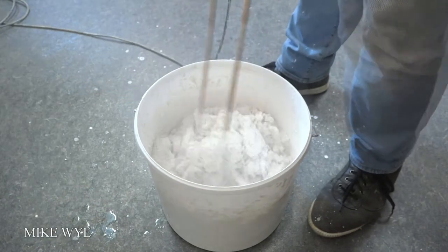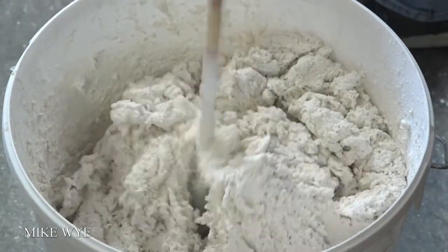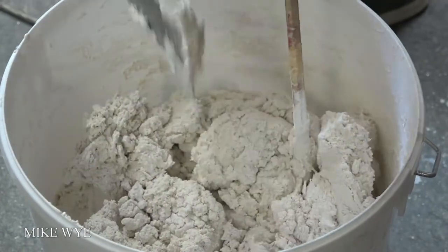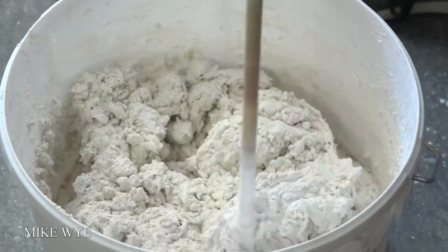The lime wall finish comes in three grades: smooth, fine, and medium. The smooth we tend to use for Venetian polished plasters and the Stucco Fine. The lime wall finish in the different grades is also a finished plaster in its own right and can be tinted with lime safe pigments.